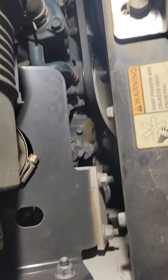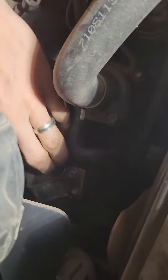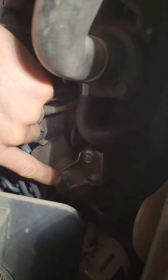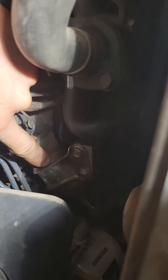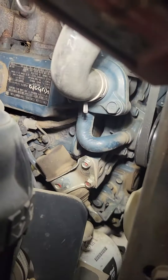This is my MT-100 and the fuel shut-off solenoid is right here. This unit is a normally-on unit, I believe. It basically shuts off fuel — I don't know why they would energize it for so many seconds. The kind that just has a spring that shuts off — that's normally off — makes more sense to me, but this is the one they are using.